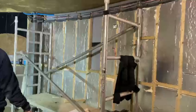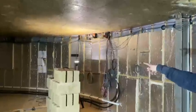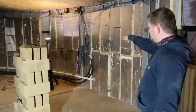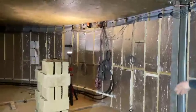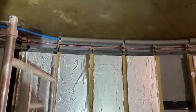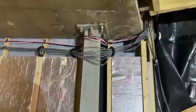Coming around into this section it's all quite dark and a bit awkward. There's a fuseboard going in there, the bar area where the orange marking on the floor is, and all these cables going to separate switching over there so they can control different volumes or zones. You can see the difference between how this banding is done here versus over there where we haven't finished wiring yet - that section still has the cables looped in with the copex around them so it doesn't chew up the cable on the banding.